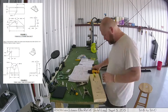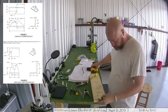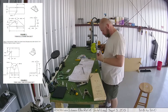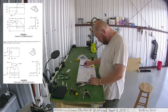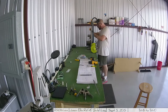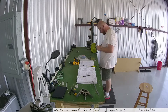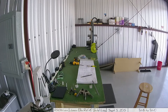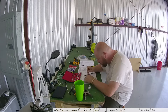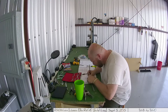These are pieces that you have to fabricate from just angle aluminum that you have sitting around the shop — thankfully they sent it to us. It's not difficult, it's just a matter of drilling all the holes and making sure everything is correct. Thankfully those drawings are actually to scale so you can hold the piece up against the drawing and verify it. Mostly you're just going back and forth between the saw and the bench grinder, trying to make the best possible piece.